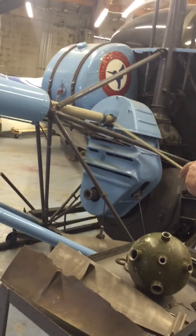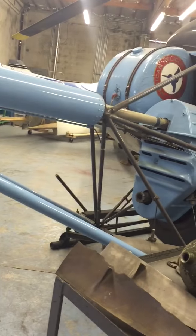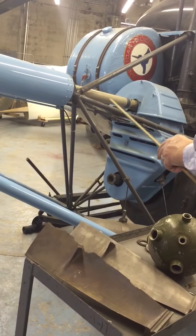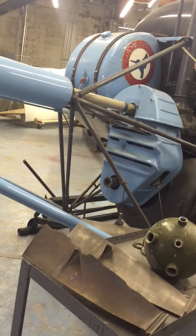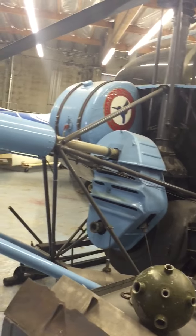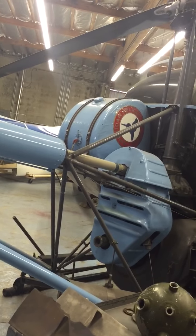These are steel tubes. Some of these tubes, like this or the aluminum tube, you can tell the size of it when the ends are fixed. Whenever you see a welded joint here, you can pretty much be sure it's a steel tube, because most of the high-strength alloys don't weld very well.